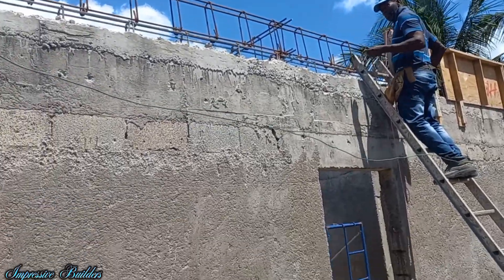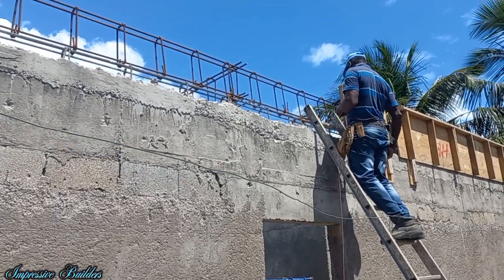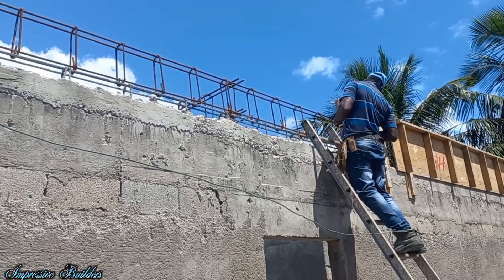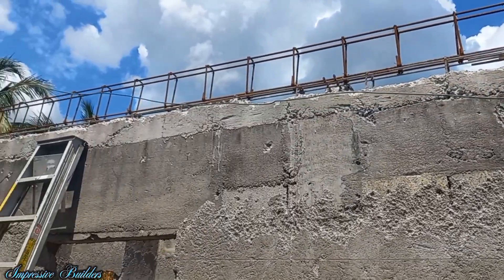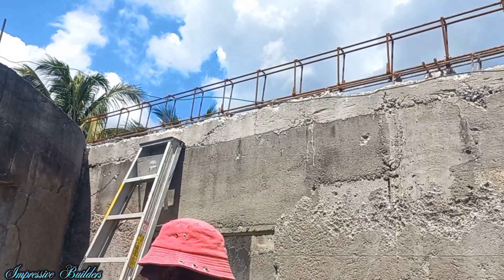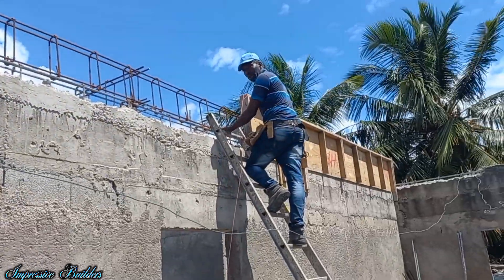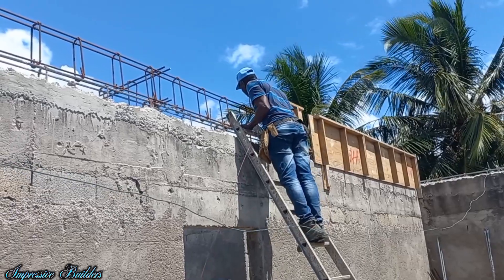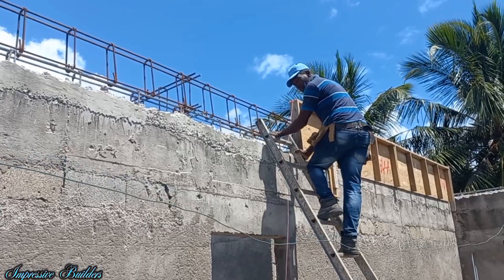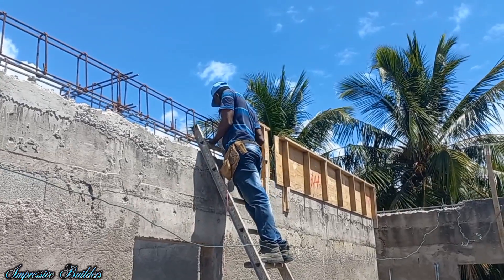String a line to go down — a nice level, straight line. You understand? Catching a level line to put up the formwork. Catch a straight edge down there, catch a piece of timber down there and string the line and level it. That's it — all of the formwork level goes down that side. Put up the shuttering board. So stay tuned, peeps. That is it.